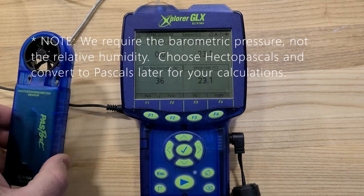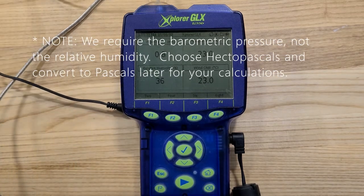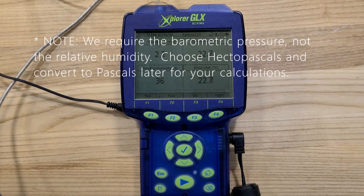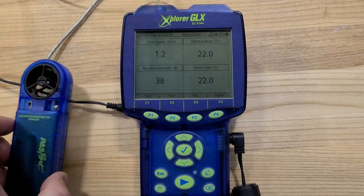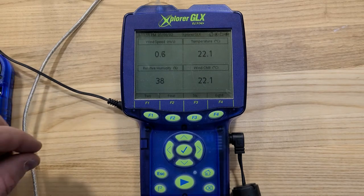When we go to the voltage part we're going to be using a different graph. If everything's hooked up properly and I move my anemometer into the wind stream, you're going to see readings for wind speed — it's holding pretty steady around 2.3 to 2.7 meters per second. This is why you're going to keep it going for a fair amount of time, just so you can get something steady and take your reading.